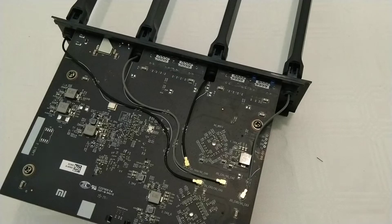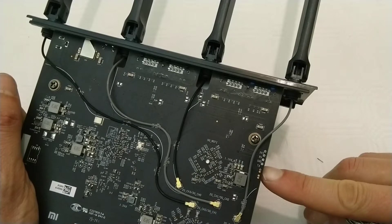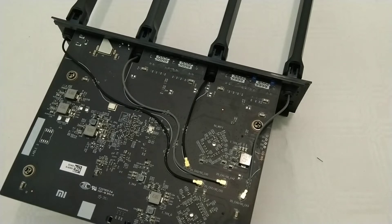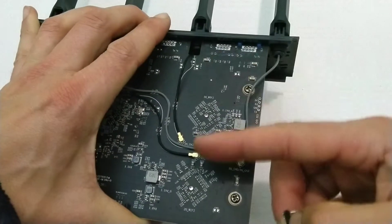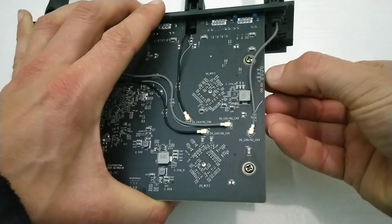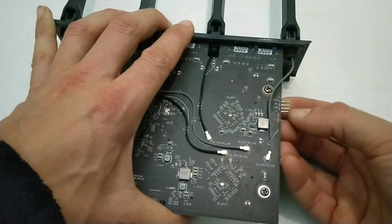Now, one piece of aluminium. Right over here you can see three volts, RX for receive, ground, and TX for transmit — these four holes. So that's where we will add a little header, basically one of these. Based on the amount of space on the side of the PCB and how close the aluminium housing is, coming in from the other side is probably best, and soldering it like that.